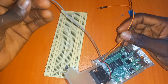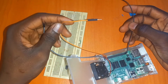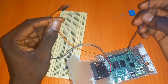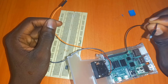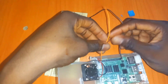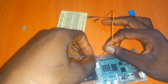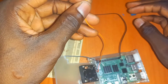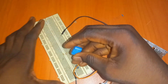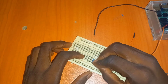The first wire is connected to pin 1 of the Raspberry Pi. The data pin is connected to GPIO4, which falls on pin number 7. The third wire is connected to pin number 39, which is a ground pin. So: pin 1 is VCC, pin 7 is GPIO4 for data, and pin 39 is ground.